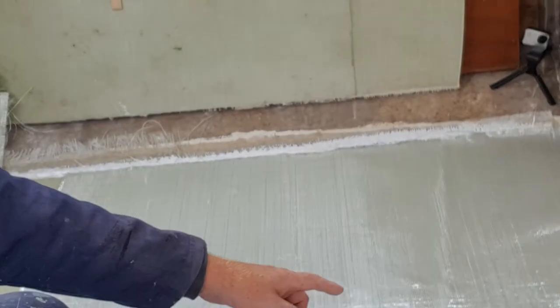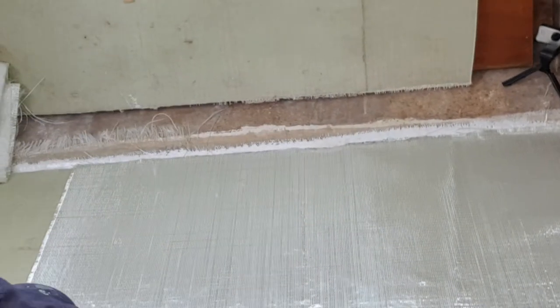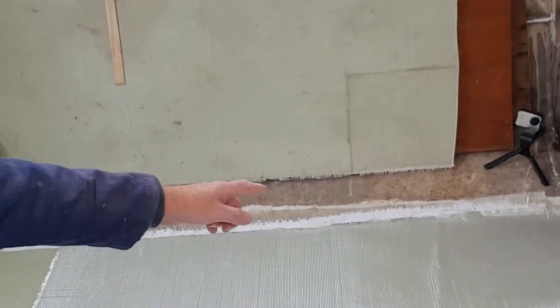Okay, it's sole glassing day, which means getting this sheet of glass, combination glass, resined on. Down here, ish, is the gap between the two panels. I'm going to PVA along the shoulders so that we don't glass the new sole in before time, because I need to flip it over, fill the gap between the two panels with thickened resin and chuck another layer of glass on the other side. So let's get the PVA down and see what happens after that.